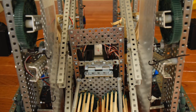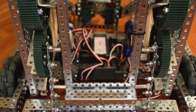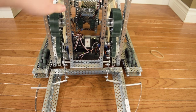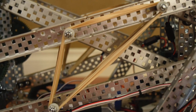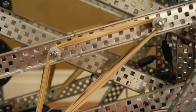The motors are geared with a 12 to 84 ratio, which helps because the motor could not power a lift this heavy if it was driving the 84 tooth gear by itself. The gears in the middle are pretty important, and to prevent the gears from misaligning we put two gears in the top section to ensure that the gears are always meshed properly. The top of the lift holds the cone intake, and the area in the middle near the gears holds the mobile goal intake. One thing about this lift is that the top section folds inside the bottom section, making them cross in the middle — which is why the double reverse 4 bar is also sometimes called a bowtie lift.